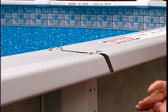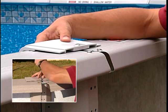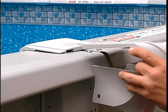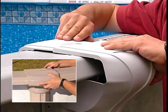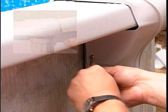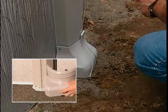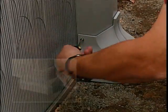To install the two-piece wrap-around cover, slide the inside cover into position and align the hole in the inside cover with the cage nut attached to the top plate. Secure the inside cover using the stainless steel hardware. Slide the outside cover onto the inside cover, making sure the inside cover is in the slot of the outside cover. Align the holes on the side of the bottom wrap with the holes on the top of the vertical and secure using the sheet metal screws. Place the bottom pedestal onto the bottom of the vertical and align the holes on the side with the holes on the bottom of the vertical. Secure using the sheet metal screws.